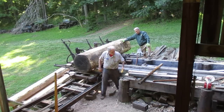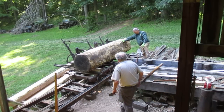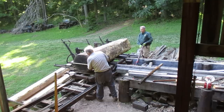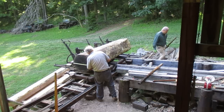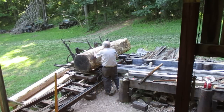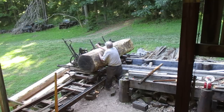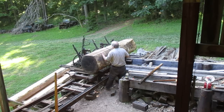So this is rough cut lumber. It's going through a planer and going through an edger and going through about everything you can imagine. So we're all right on that. On the cut here, we are at 23. So we're going to go to 21 because that end down there is the small end, right? Yes, sir. Except for that knot, how that factors in. I think we'll take one board off of it too. Okay.